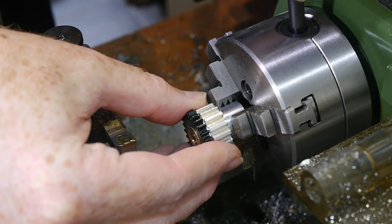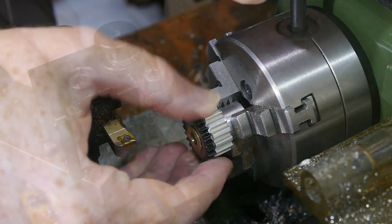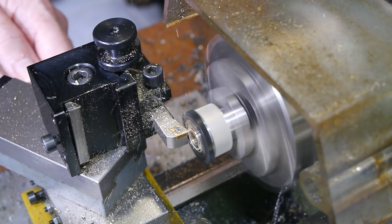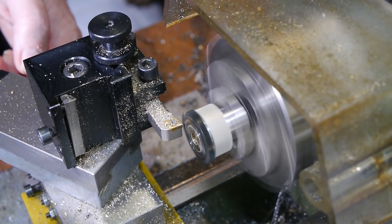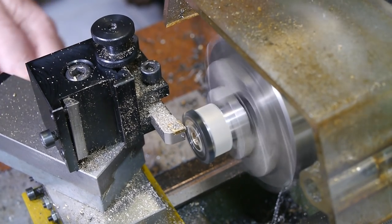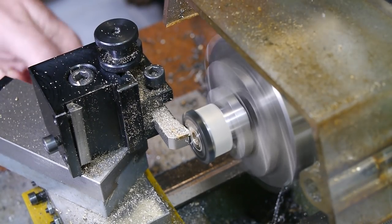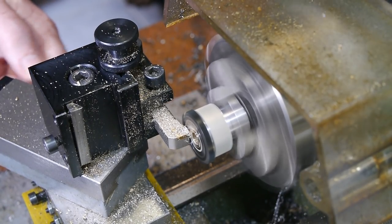The next step was to bring the part down to size by parting off and removing the excess material. After removing the extra length of brass, I ensured the lining was still protruding a tenth of a millimetre from the steel face of the gear, to ensure there was no contact between the steel and the bushing the gear runs on.